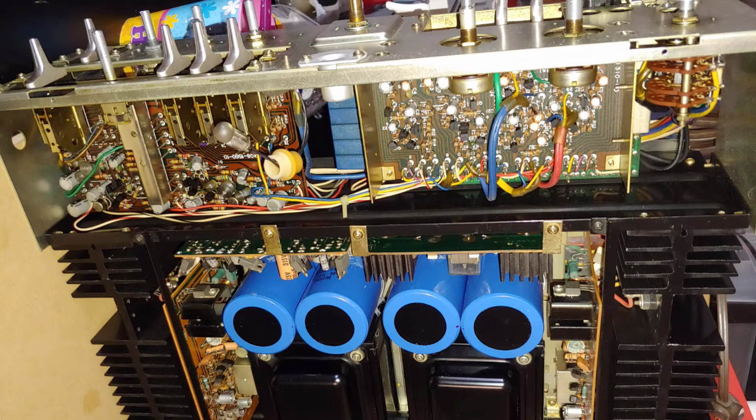You can see here kind of in the center, dead center, the blue potentiometer. It looks like a bunch of squares stacked together. That is a point of contention. It does start to wear a little bearing that's in there, so you lose the clicking motion of the stepping in the volume. And it was, for me, a problem of fading in and out of left and right channel.